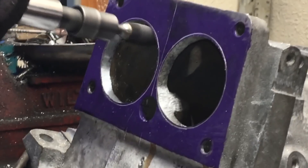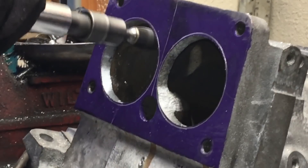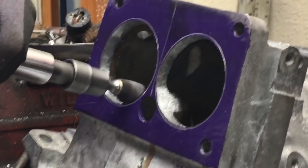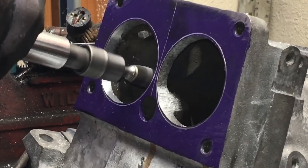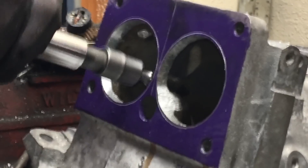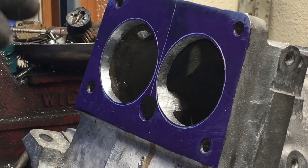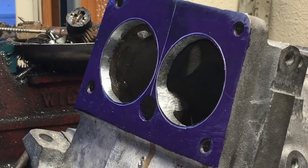You can see how much smoother this burr is than that large single-cut. As you're coming around, you can feel it taking out all those larger leftovers from that other bit. Try to smooth this out and keep working a little bit closer to your line, but don't go all the way to the line yet because this is not the final burr.